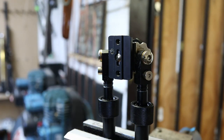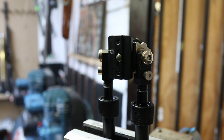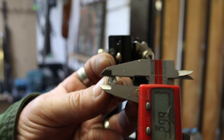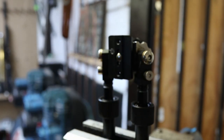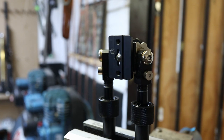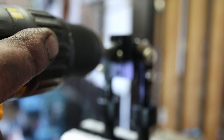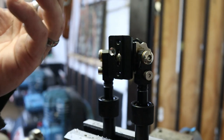I'm going to get the countersink bit now. Again, if you want to be anal, I need to stop using that word. You're going to aim for the point on the countersink. Let me get in camera. That's 7.8mm, so you want to be going in until you've hit an 8mm diameter. Guessing game, it's up to you. Doesn't matter whether you hit this track, because you're not going to damage it, and you can't see it once it's on the gun.